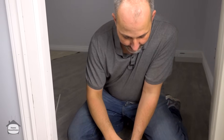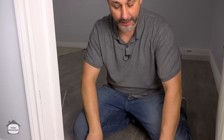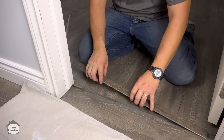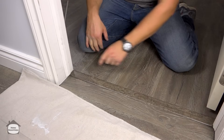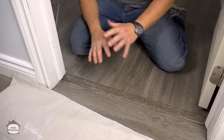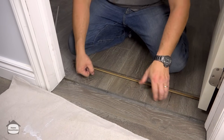The reason we have the floor going in two different directions here is because we did a huge room down a hallway and then did a bedroom. There's no way we're going to line these up, and we didn't want boards getting cut from wide to thin in two different locations. By changing the direction of the floating floor in the bedroom, we avoid that conflict. When installed, it looks fantastic — if the grooves were going the same direction it would really conflict with the eye.